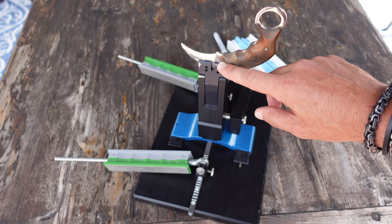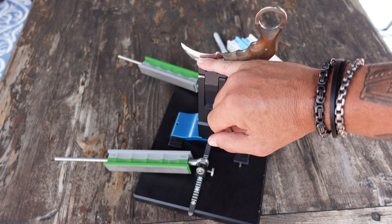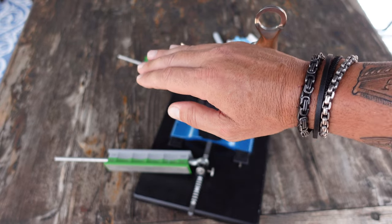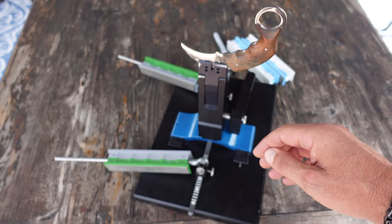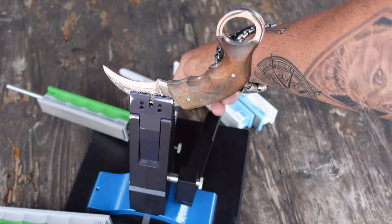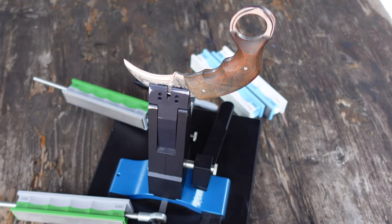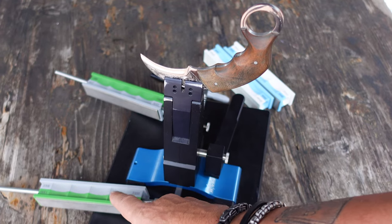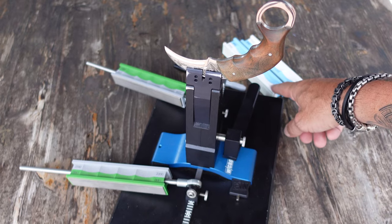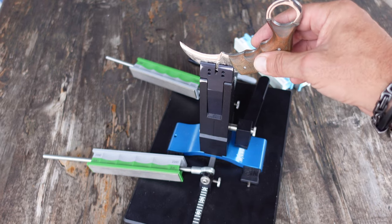As far as the karambit, since it is small and a relatively short blade, what I did is put it as high as I possibly can on here using the Wicked Edge system, and I also have it flat — from the tip to the back — trying to get it as flat as possible to make the sharpening process that much easier. Utilizing my Sharpie I found the proper angle, set up the angle on both sides, got my stones out, and I'm going from 1500 to 2200 to 3000 grit, which should be more than enough to get that razor edge I'm looking for.